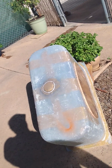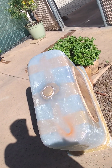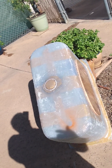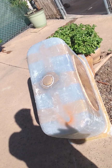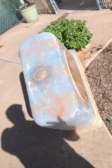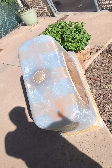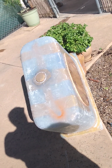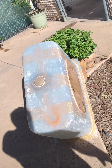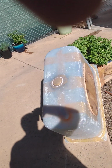It started cracking and popping. It had leaks around the valve, but it didn't matter. Apparently those leaks sprang up from the pressure and got through. So it was enough to get it to pop and break the vacuum. That's all you're doing. You're not really forcing it to separate per se, because there's a vacuum and it's not bonded to the plug. It does not stick to silicone in this paste wax. So this is all the stuff I learned taking on this project. It worked like a champ, and I would do it that way 100%.